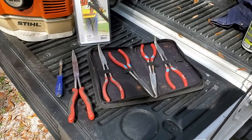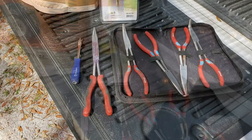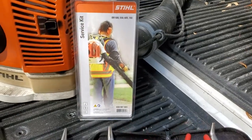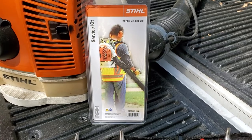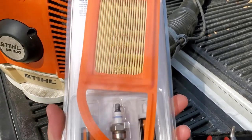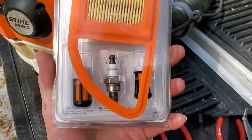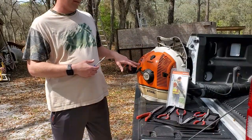The basic tools you're going to need for this task: some long needle nose pliers, any kind of T25 star head to loosen the screws on the machine. And if you can find one of these, you'll be golden — it's a one-and-done service kit. It has the air filter, the spark plug, and the double fuel filter system I was talking about. One fuel filter has two plugs coming out of it; the other one has a single.